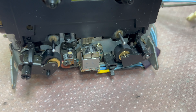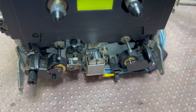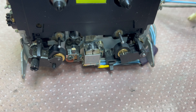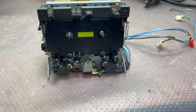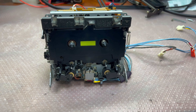The main thing I need to do is relap this head — it has a minus 3 dB at 10 kilohertz. This means the tape is not fully touching the head, so I need to make it flat again so it can work. I'll be working on relapping right away. Thank you, see you soon.